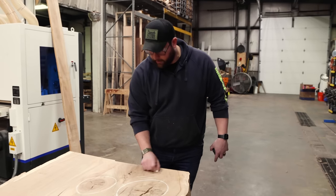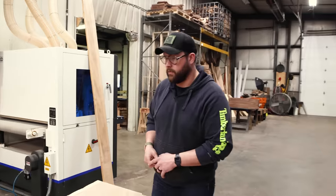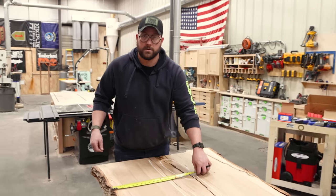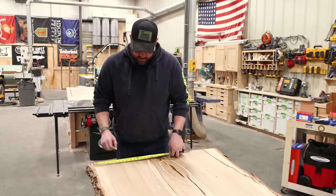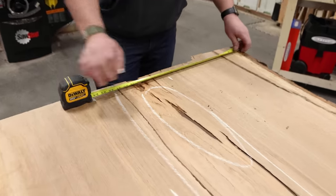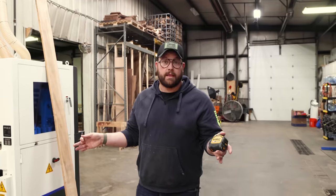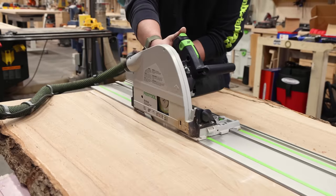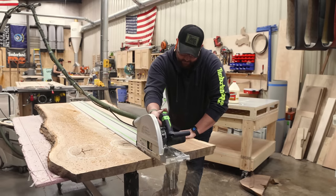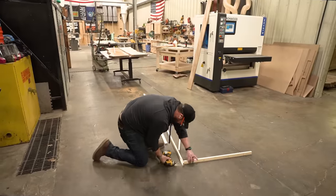We've got some ray flecks in this area, which are indicative of white oak — one of the reasons I love the wood. So the reason I picked this slab is because I can still get away with 12 or so inches of material and work my way around most of these imperfections in the center. But to make this easier, I'm going to find the center of the slab, take a chalk line, cut it down the middle, and then build a frame to dictate how much material we get rid of on each side.